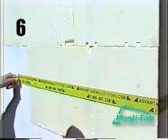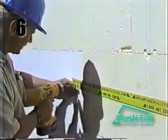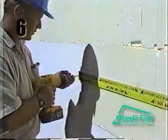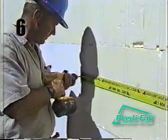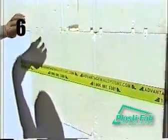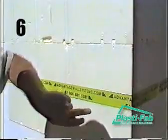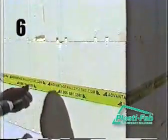We will go over to this side and do the same. When we are screwing these on, we like to make them tight so we start at an angle, then pull our screw. The strap has two functions: if the concrete is too wet, it won't let the wall pull apart; or if they over-vibrate it — we vibrate the walls all the time. The other function is that you can fasten any exterior siding or corner battens right through into this siding screw.